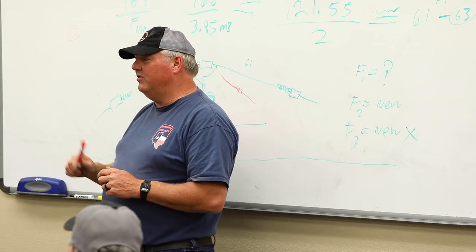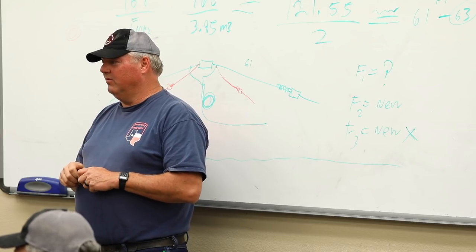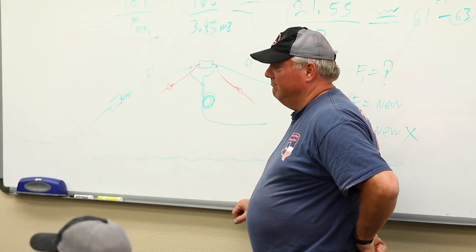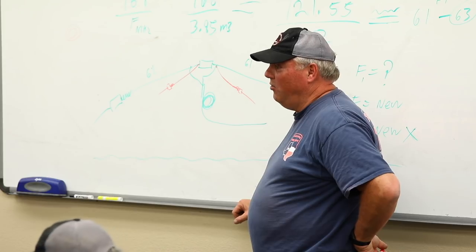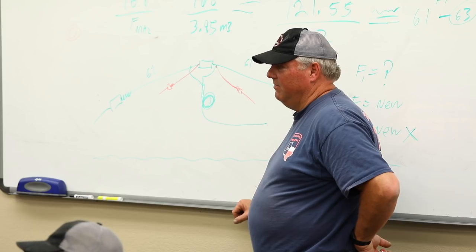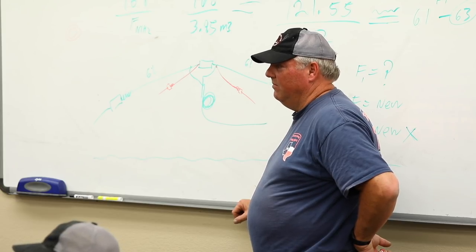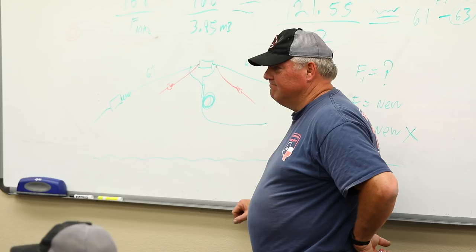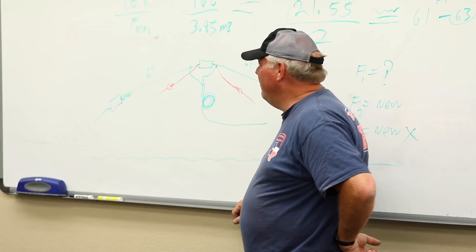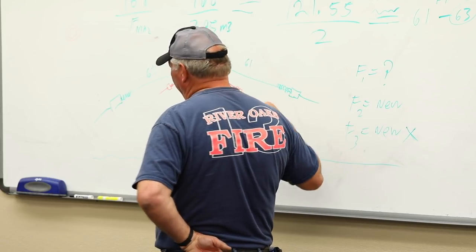Don, John, you have a question? Yeah, John. What I did, 80 meters is a pretty wide frequency spectrum. It is. It's hard to get matches. 3.5 to 4. You build the antenna for phone, and you trim it, and then you have your insulator there. And then you add on to the insulator a short piece, it only takes about this much to take you down to the middle of the CW band. The tail. And you clip it on there. I have some on my fence right now. And it works good. It moves the resonant frequency down.